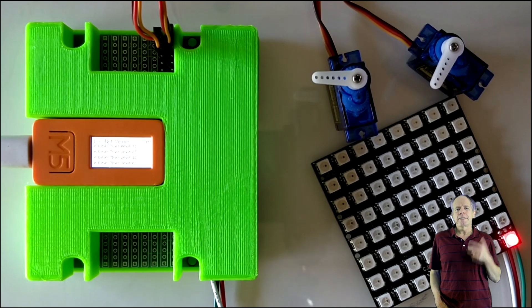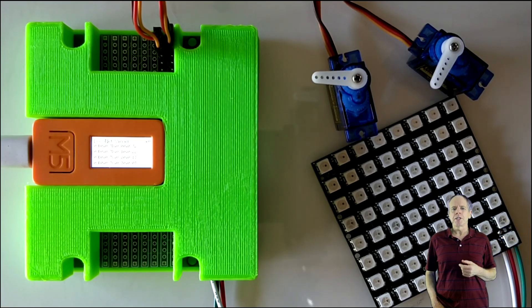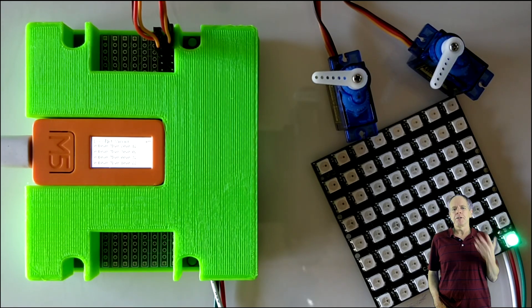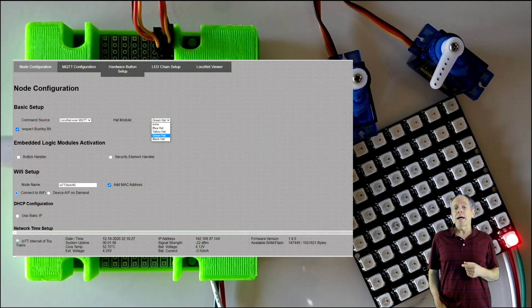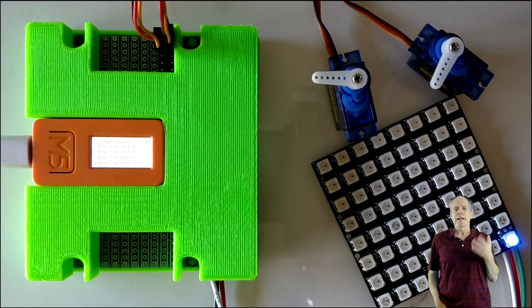The LED chain is limited to 32 LEDs plus the onboard LED. The idea is to use it for displaying servo positions or activator button statuses. And as with the blue hat and yellow hat, the LEDs can have individual colors and can be static or blinking with various transition modes. Like the other hats, the green hat will have a configuration webpage, and the standard configuration of just 16 switches with input buttons and consecutive switch addresses will be configurable with the click of a default settings button. But if you wish, it will also be possible to configure outputs, buttons, and LEDs individually — just as on the other hats. It's up to you.